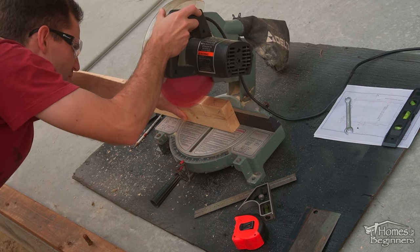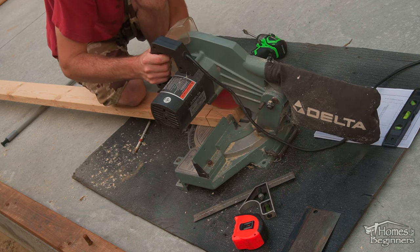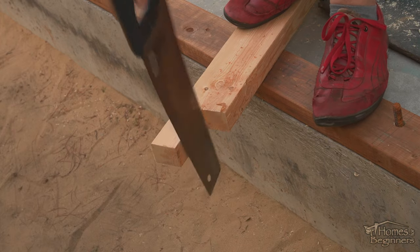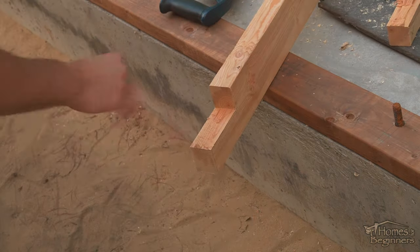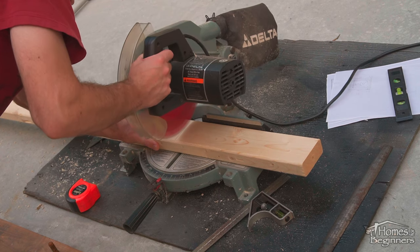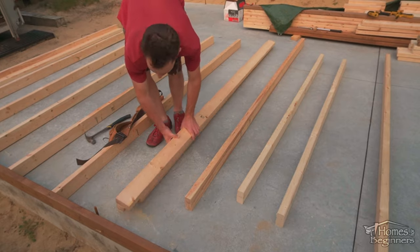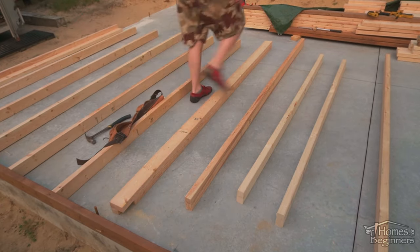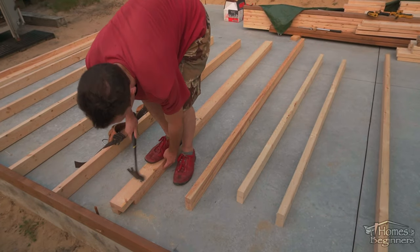As for installing a stud over an anchor bolt location — some notch it out and leave it as is, but this isn't fully structural. The bottom of the stud is notched out and this will face the inside of the building. The notch is high enough where you're able to slip on a nut. An additional stud is then cut and these two studs are nailed together every 24 inches. The nails are installed on an angle as they are 3.5 inches in length and would come out the other side otherwise.